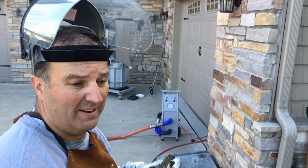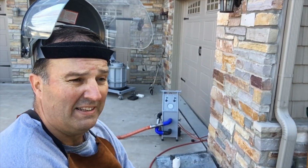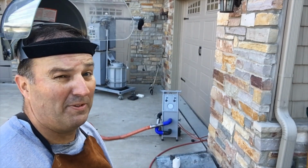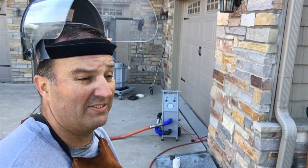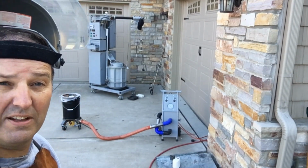All right, so I got more vacuum, about 13, 14 inches of mercury, so darn near half an atmosphere, and at the temperature, another 100 degrees, so it's almost 1700, so it's probably going to be the best chance I got. So here goes the larger one of the two.